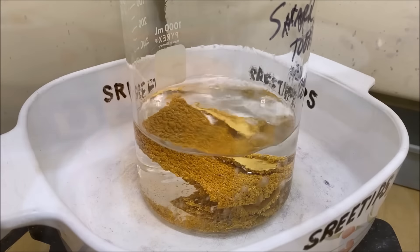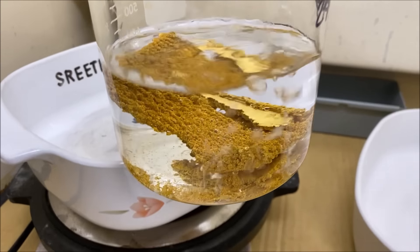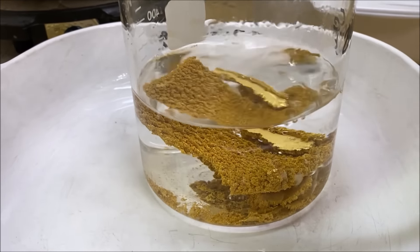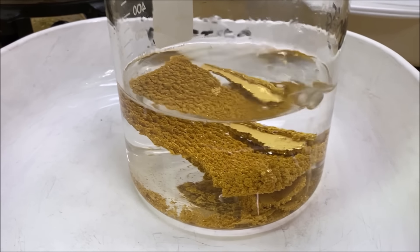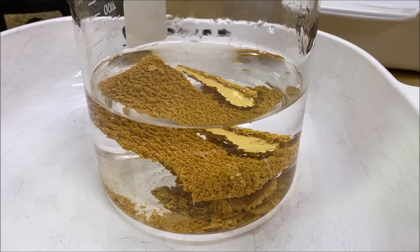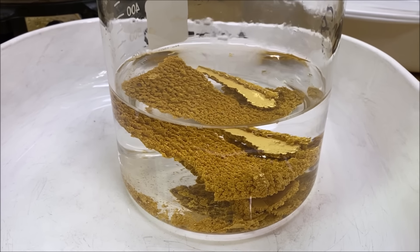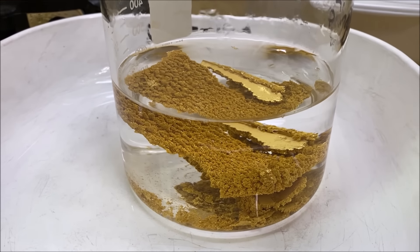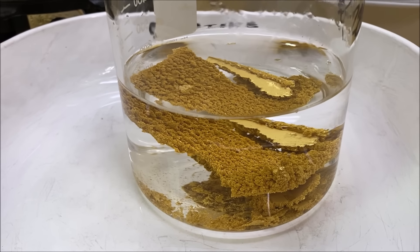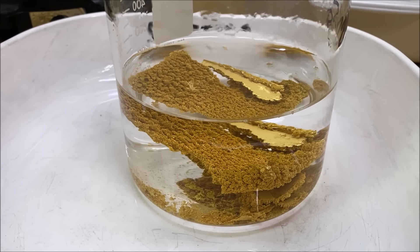I had the gold boiling in distilled water for about half an hour. I'm going to pull this down off the heat, let it cool off, and get that water off — it could contain a little bit of gold, so I'll add that to my waste containers. Then we'll go ahead and dry out the gold and offer it for sale. This concludes part three of the Electrolytic Gold Refining Cell series of videos. Thank you for watching.